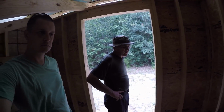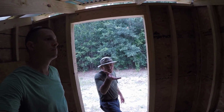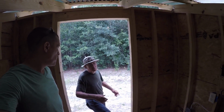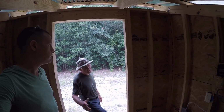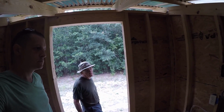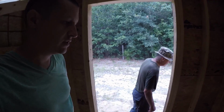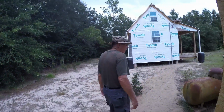basically they want to make sure that everything's connected to the earth. So that voltages can't rise way above the earth because people are standing on the earth, and that makes it a little safer for them. Plus, lightning strikes and stuff then go to earth, and hopefully doesn't destroy all this expensive equipment. Yeah, that would be a disaster. We get a lot of lightning here. You do. This is a high lightning area.